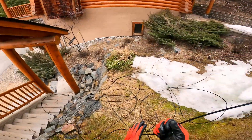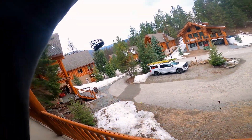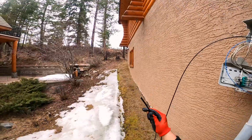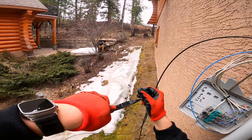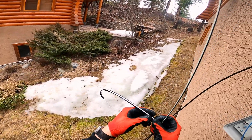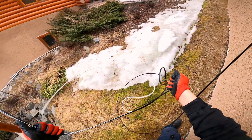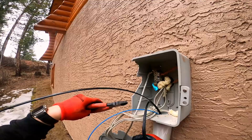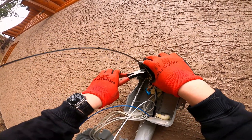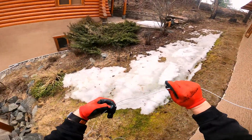There we go. I get that stripped, grab the needle nose, go right at it like that, and pull back. Ideally you want to pull everything at once with the string — the drop comes with it. Cut that off, and now with this I try to leave it nice and long. Pull the string off the fiber.